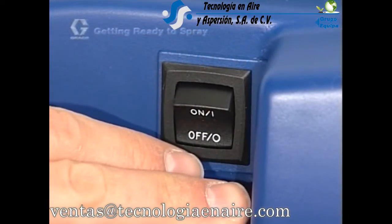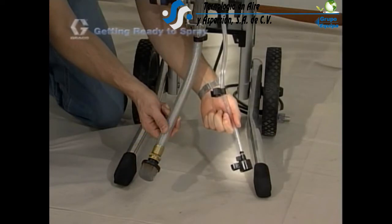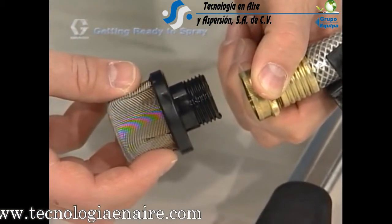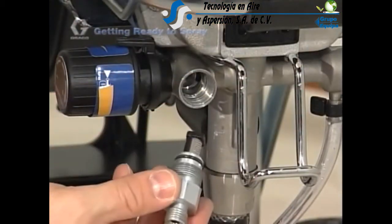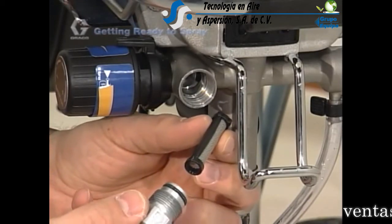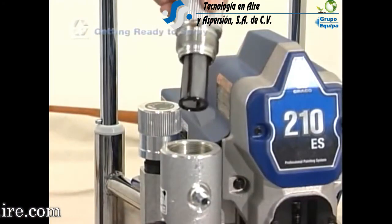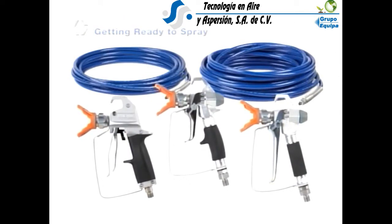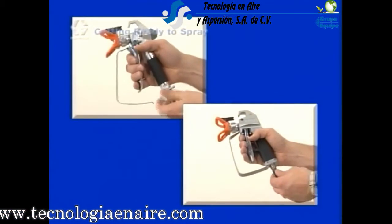The power switch is located on the backside of most sprayers. The suction tube — the larger of the two tubes — draws the material or paint into the system. The smaller prime tube or drain tube is used for draining material or waste from the system. The inlet screen is located at the bottom of the suction tube and prevents objects such as twigs, leaves, or rocks from being sucked into the system and damaging your sprayer. The power flush attachment is an easy way to clean the sprayer's system if you're using water-based paint. Some Graco Magnum sprayers come with an InstaClean filter that keeps you spraying longer by reducing spray tip clogs; it is automatically cleaned when the prime valve is used to relieve pressure. Other Graco sprayers include a manifold filter that should be removed and cleaned after each job. Your Graco sprayer comes complete with an airless spray gun and hose; all Graco guns come with a tip and tip guard and a removable gun filter for easy cleaning after each use.